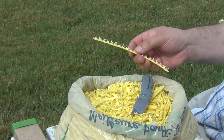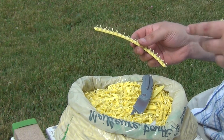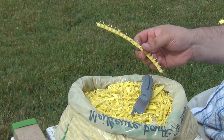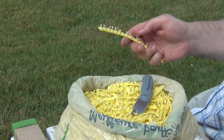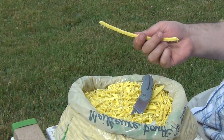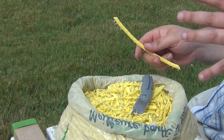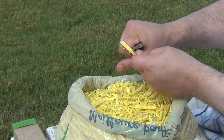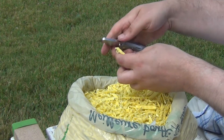I had a bunch of these — they're basically screw ties, used to hold in screws for strip runs, commonly used for standout screw guns and screw floors. They're basically like zip ties but relatively heavy, thicker than a standard zip tie, and kind of annoying to cut up. They should be very easy to cut with a knife, and you cut them basically on a push like that. You can't really slice it like a piece of rope because it's hard plastic, so you just push right through it.